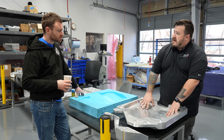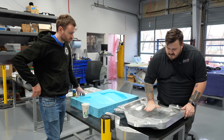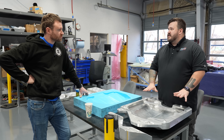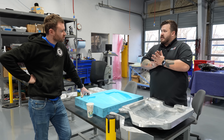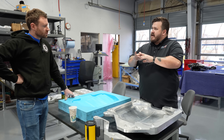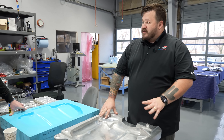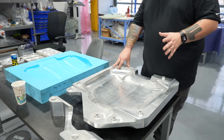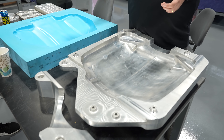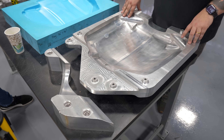If you've got near-zero atmosphere inside the bag, the 14 PSI — one bar — around us is going to be crushing that into place. That one bar is actually really effective; you can get really nice parts using just that. It consolidates the material — your carbon has a weave pattern, and by crushing those weaves together it makes a stronger part. The individual layers are less likely to shear across each other. The closer you can get to absolute zero vacuum the better, but that introduces other issues — even a tiny pinhole expands exponentially with decreasing pressure.